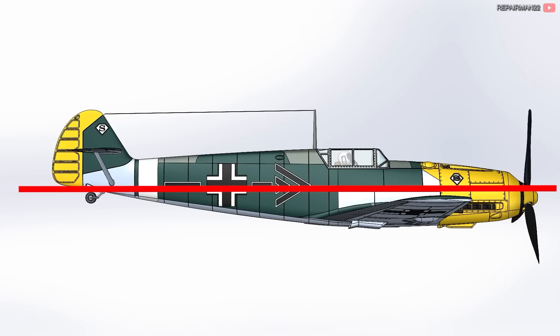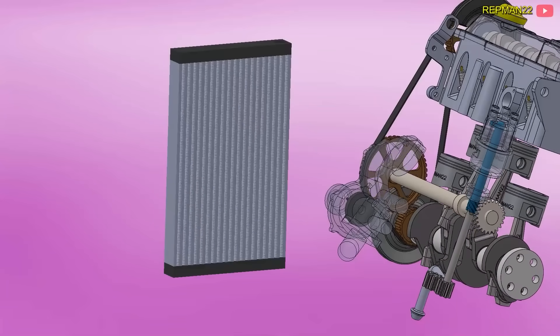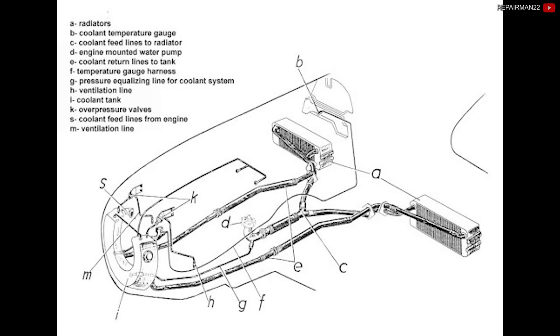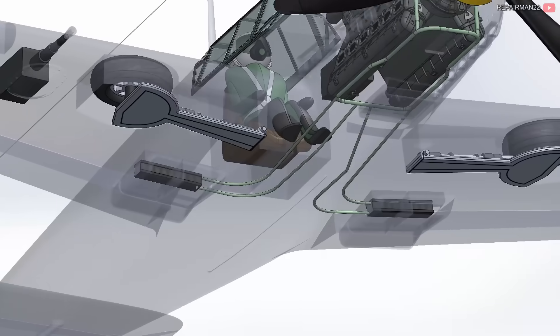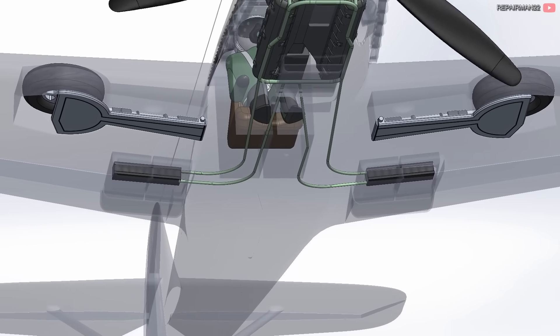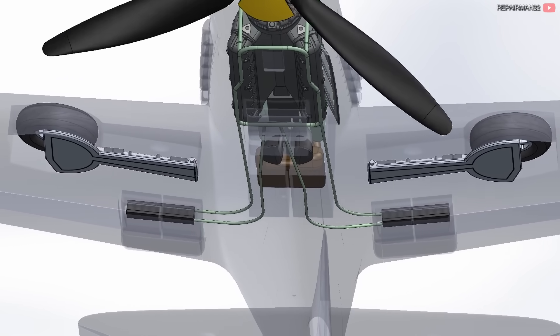The third improvement sought was to increase the engine's operating coolant temperature from 195°F (90°C), as used in cars today, up to 250°F (120°C). With an extra 55 degrees, the temperature difference between the air and the radiator increases, making the same radiator perform better. This would allow the radiator to be shrunk to almost half its original size, giving smaller air intakes and better aerodynamics. With smaller radiators and less water, the weight is also reduced.